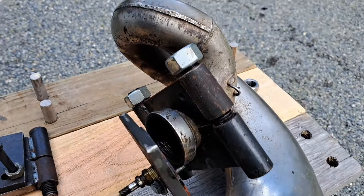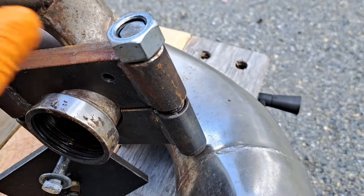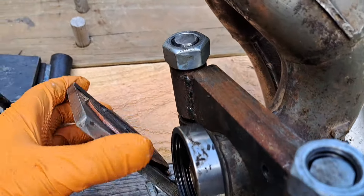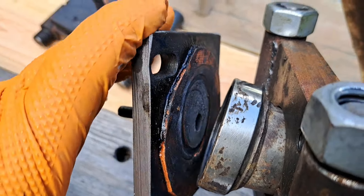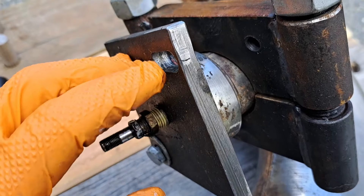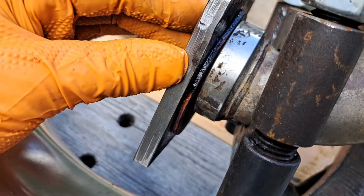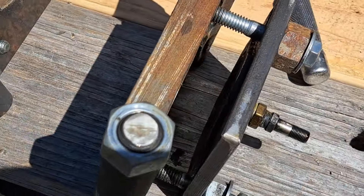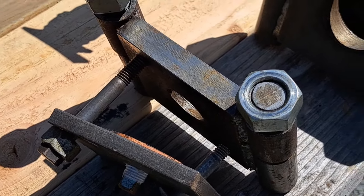Here's a little image of the fixture I made. It just kind of clamps around the flange, clamshells and splits here. There's another plate that has a piece of rubber glued to it — eighth-inch rubber — and you just bolt that up. You can see the bolt here, and another bolt goes here, picks up that thread, holds it tight and makes a seal around the flange. I tapped in a Schrader valve right there. You may be able to buy something comparable from a motorcycle distributor or even Amazon.